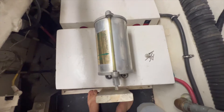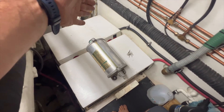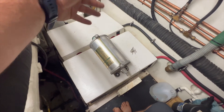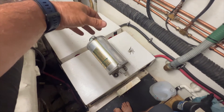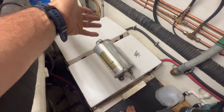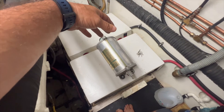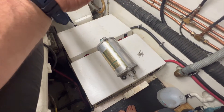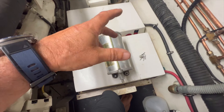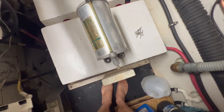You can actually see through the sight glass now. What happened was — you're really supposed to use the Hynautic fluid, but most people don't do that anymore. It's a 50/50 mix of glycol and distilled water. But if you don't use the right glycol, there are silicates and borates in it. Over time that stuff settles out, and it actually cakes up and turns into a hard calcified plate on the bottom, so nothing could get out.